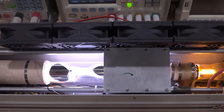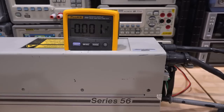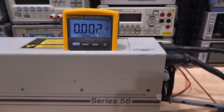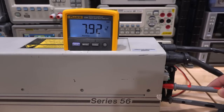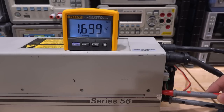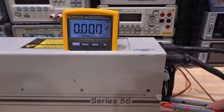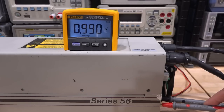The laser cavity has now stabilized and the color has settled to where it's going to be. I want to measure the wavelength and spectral content coming out of the laser. The helium pressure regulator set point for this laser should be about 7.62 — we're reading 7.92, a little bit higher, we could lower it potentially. The high-voltage power supply is reading 1.6 to 1.7 kilovolts, which should be around 1.7 — pretty close. And the plasma discharge current is about 100 milliamperes, which is also about correct.